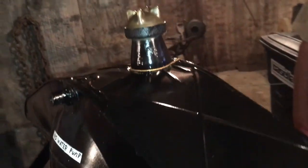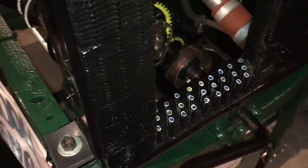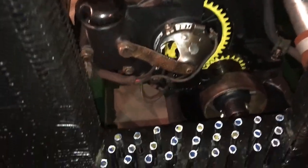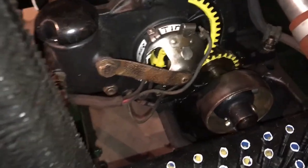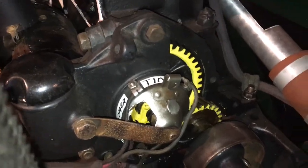There's no water pump. This works on a principle called thermosiphon: water will rise in a closed container. When water gets hot, it rises up to the radiator. As it rises out, cooler water comes in to take its place — it just flows naturally. There is a fan to pull air through, but there's no pump. As one speaker notes, the only thing a pump does is give you something else you've got to fix.